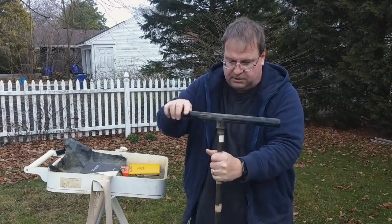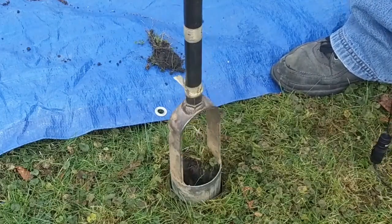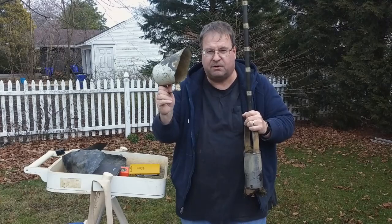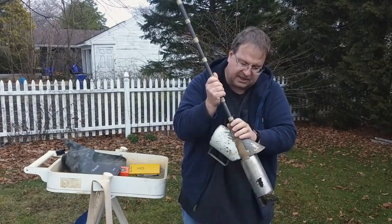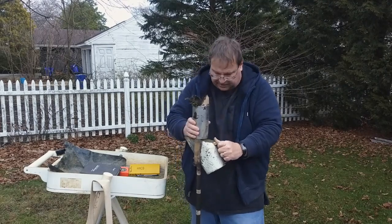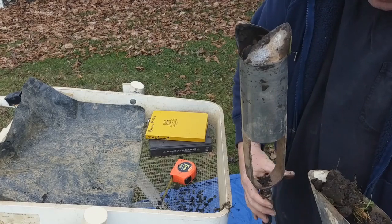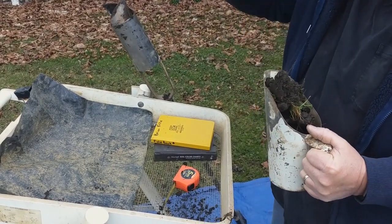Basically, we select the place we're going to drill our hole and just slowly twist the bucket into the ground — hopefully we don't hit too many rocks. Once the bucket is filled, we lift it back out. I have this hand scoop: I shaped it so it fits in between, and I welded a little latch on the back so we can turn it up and it stays in. This is really the secret that makes the bucket auger work well. Once you have that locked in, I can turn this upside down and tap the handle. The scoop becomes very important once you have a really deep hole with two or three stems making the auger very long, because then your auger is up in the air whenever you're tapping it on the T-handle.